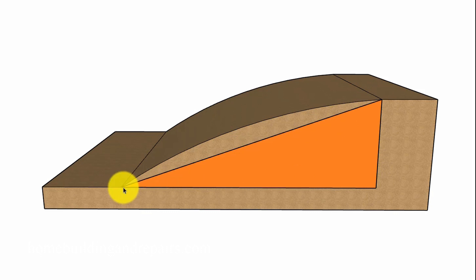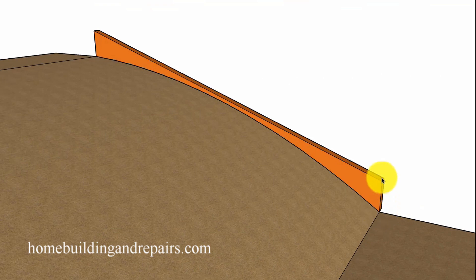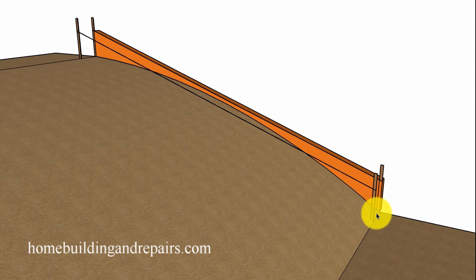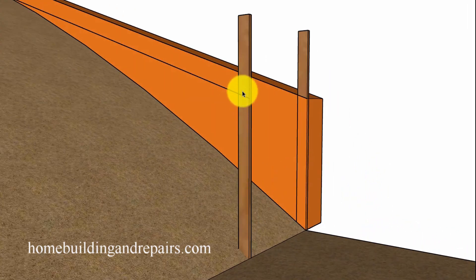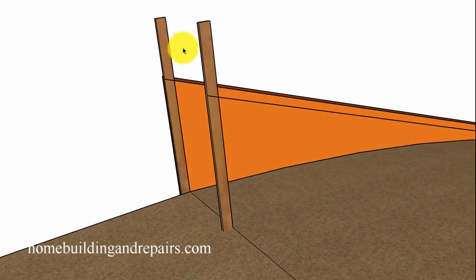In order to do that, you might need to actually raise the triangle — the base of the triangle, the line you're going to use for the straight line. In this case we raised it up about 30 inches. If I just tried to draw a straight line from where I want the stairs to start and stop, I'm going to have part of the hill in the way. So we're going to need to drive some stakes in the ground and raise them up to where we won't be hitting the hill at any point, so we can create a nice straight line.